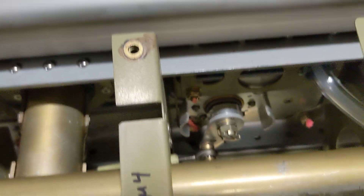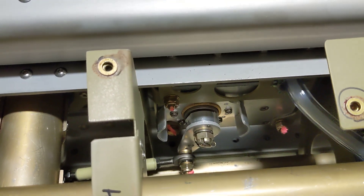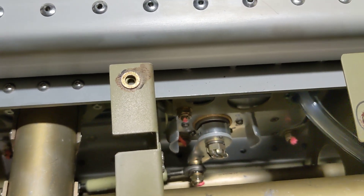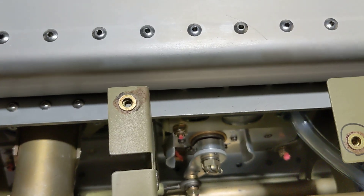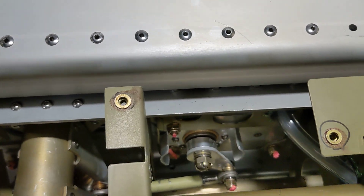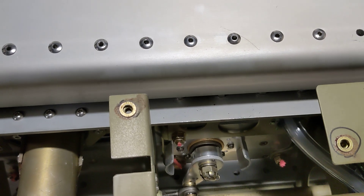And the autopilot — here's the autopilot. You can see the little autopilot right there. We put the control stops for the autopilot — they're actually completely unnecessary because the autopilot uses the same stops — but once you install them, you have to make sure the autopilot doesn't touch them before the main control stops. As you can see, it gets pretty close but doesn't actually touch in either position.